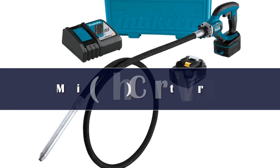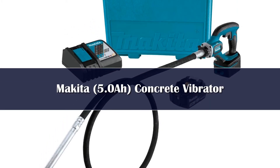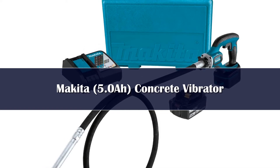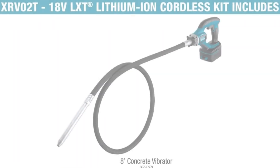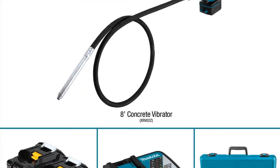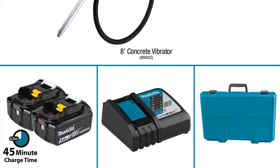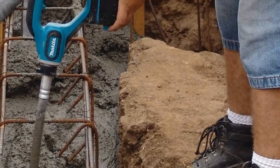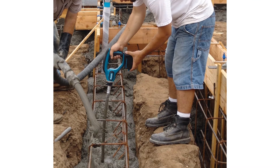Number 3. As a tool with a vibration speed of 12,500 VPM, the Makita XRV02T 18V LXT Cordless Concrete Vibrator Kit has an average running time of 41 minutes per charge. I like that you can position it horizontally or vertically using the dual-direction switch, allowing for work flexibility on your mixed concrete. It has an ergonomic design while still spanning a long shaft length of 8 feet, which is much bigger than most concrete vibrators of the same class.